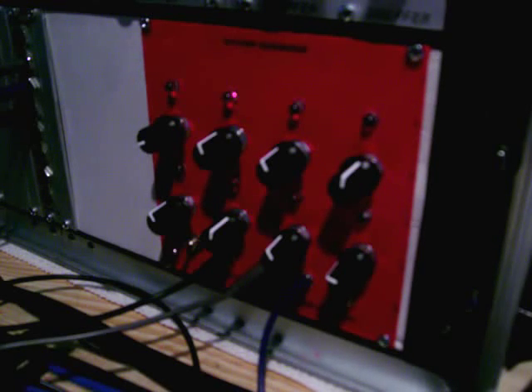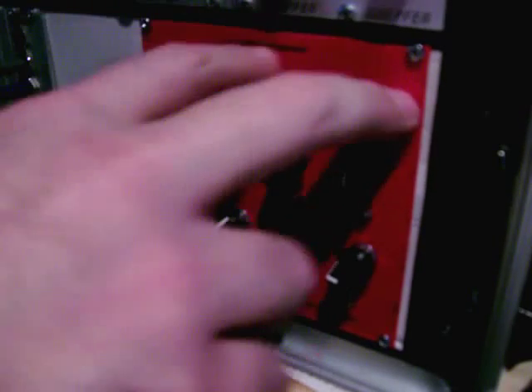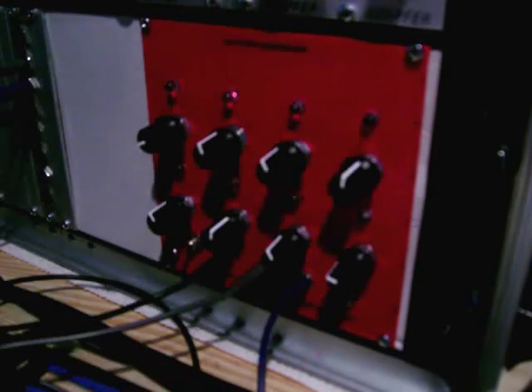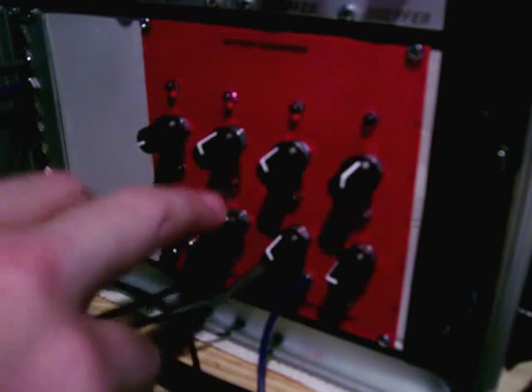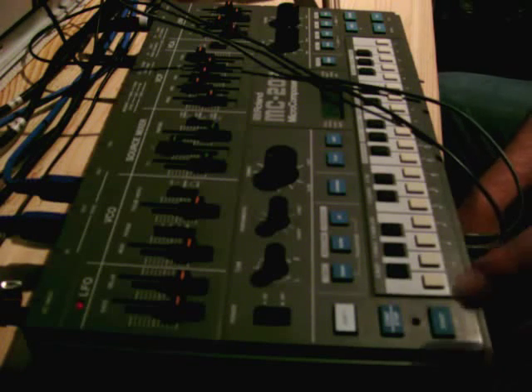As you can see it's endless fun. Time's running out, so I'll put some information up on the blog post — that's syncdot.info if you haven't been there before. This panel is made out of a CD cover, but I'm probably going to make a new version with a proper panel, and I'm going to add some switches to disable the CV outs so you can turn off individual steps. It's very simple — if you look at the schematic you'll see how simple it is and you can do your own modifications to make something that suits you.